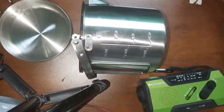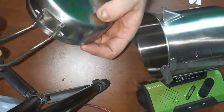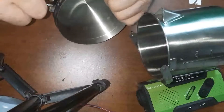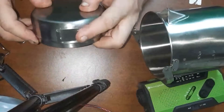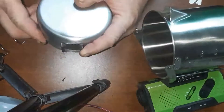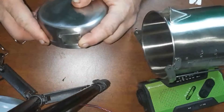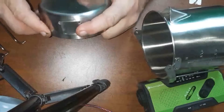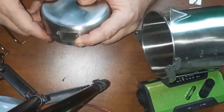It's got a couple of problems though — it's got some really crappy spot welds. You can see this one is about to pop off here, so what I'm gonna have to do is take it and try and tack weld it. I don't have a spot welder made up, but I do have a set of MAP gas welders that I can try and silver solder or braze it together with. I'm gonna give that a try.